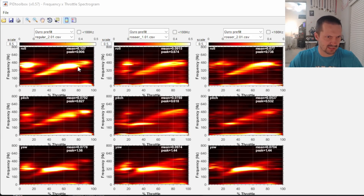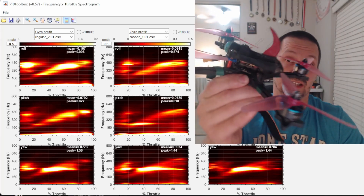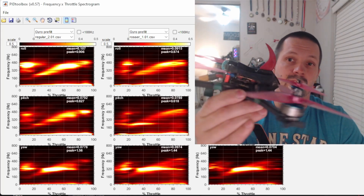This video is taking a little bit longer than I wanted — I decided to show some of you the very basics of black box noise analyzing, and I think that could be helpful. Is it all bad and horrible? Not really. On a 5-inch drone, if you have a frame resonance below 200 Hz, that could be concerning. If you have a frame resonance below 120 Hz, then it's just bad — pack your bags.